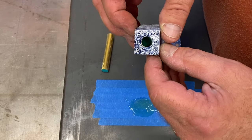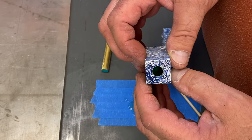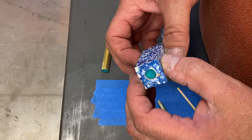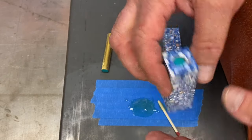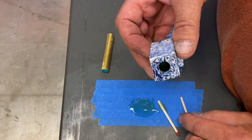I'm letting the tube go just a little back into the blank because this was the entry hole, and a lot of times your entry hole is just a little bit wider than the exit hole of your blank. So I may just go ahead and push this back. Since we don't have to align the blanks, we'll get it close to the opposite end and then we know we've got a tight fit on both ends of the blank with our tube.